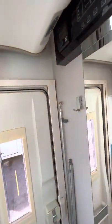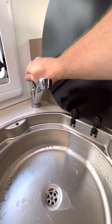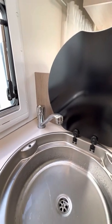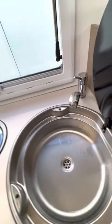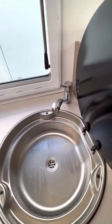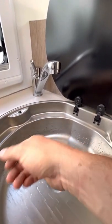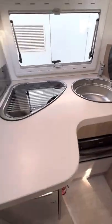Before using your boiler for hot water, turn your pump on, come over to the tap, and pull the water through — make sure you're on the hot side. If the pump turns itself off after you close the tap, that means there's plenty of pressure and no leaks. Pumps only turn themselves off when they reach pressure. It's really important to do this to check the boiler is full of water before you try to light it up.